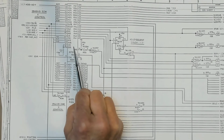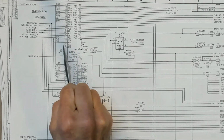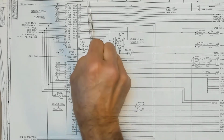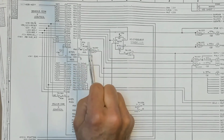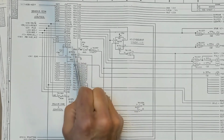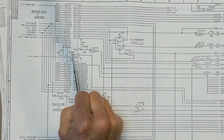So you would have these two 8755s, and then by enabling one of them or the other one, you could just swap them back and forth, because all of these outputs would be tri-stated. If you do a reset on this and tri-state these, you could essentially have two 8755s in parallel and then flip back and forth which one you're using.